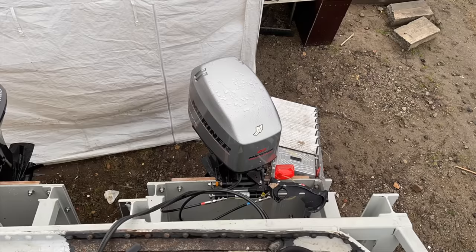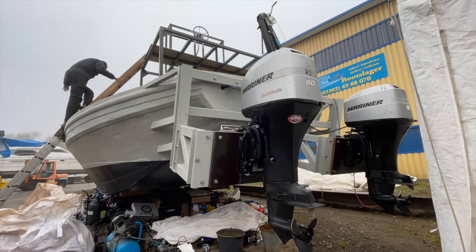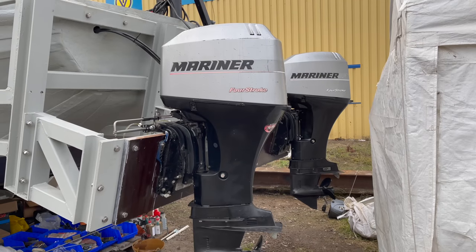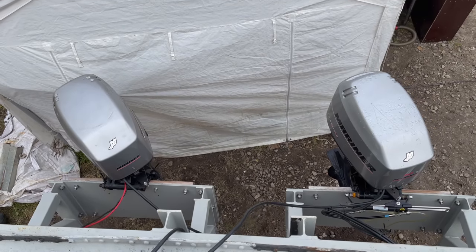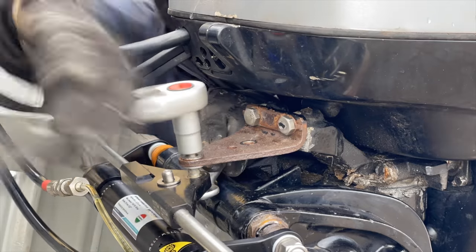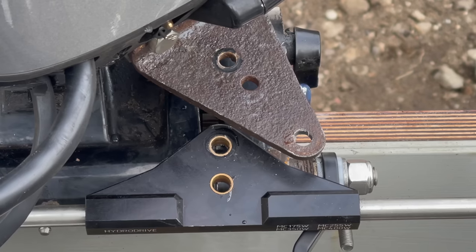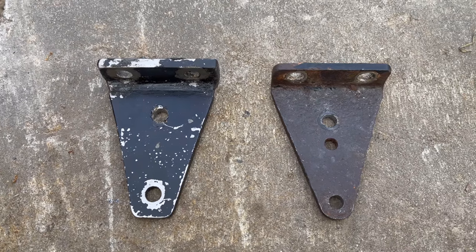As the system is slowly filling up with hydraulic fluid, the motor will start to move until eventually you can move it all the way back and forth. When looking at both engines, you can see that the angle of inclination of the port side engine — that's the one on the right side of the frame — is a little less than the starboard engine. That's because of the mistake I mentioned, where I used the outermost hole of that steering bracket. After I detach everything, with the piston fully extended and the engine fully inclined, the holes of the piston's plate align with the innermost hole on the steering bracket. So now all I have to do is fix those holes so that I can fit a screw through on both brackets.